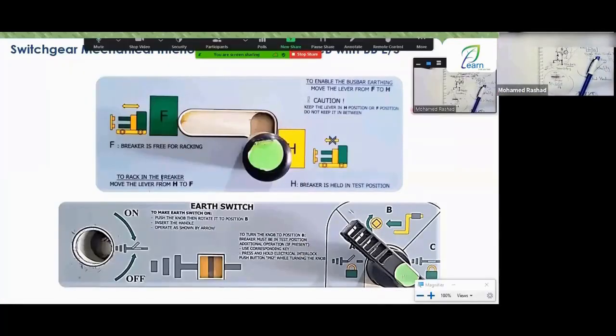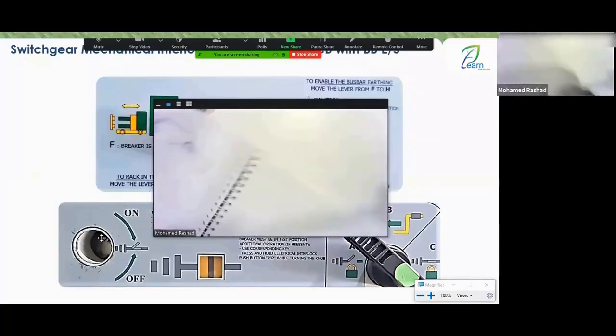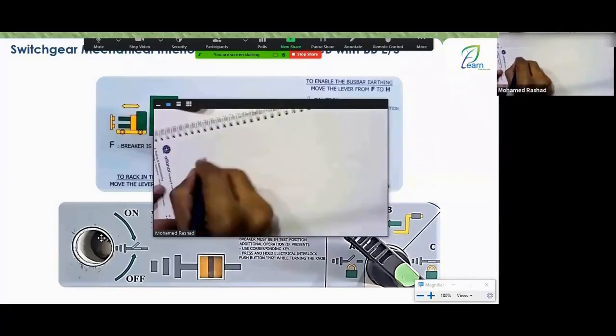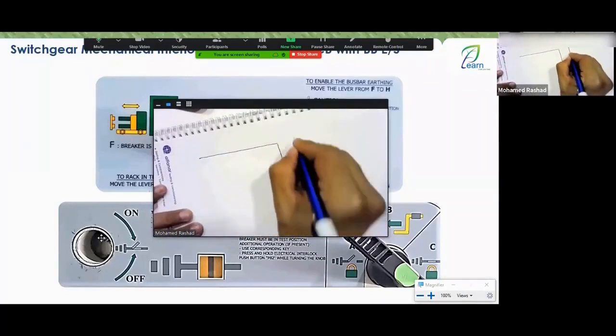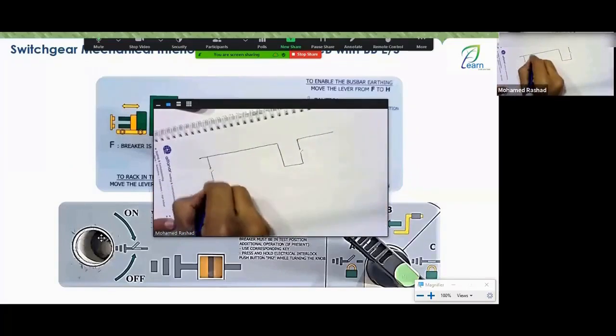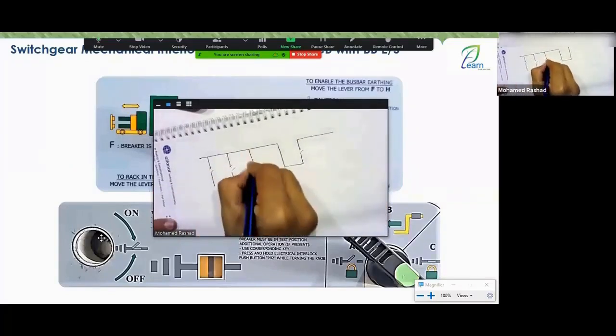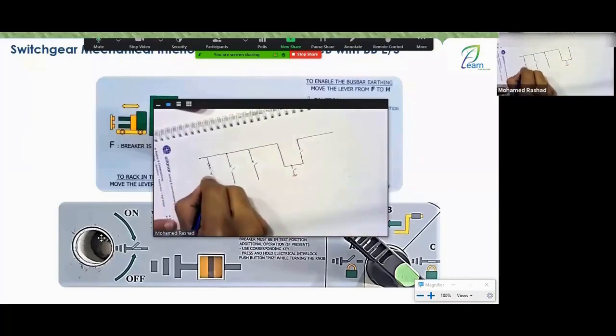Here it is again. The idea of it. Now you have it like this. Now you have here your entire bus bar. All right. And here is your bus riser. Then here you have your bus section. All good. You have a set of breakers like this. And here, of course, you have the bus bar transfer switch. All right. Of course, these are all withdrawable circuit breakers.